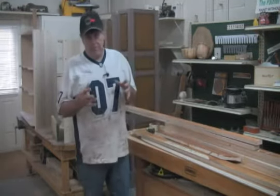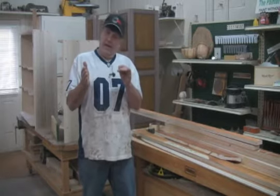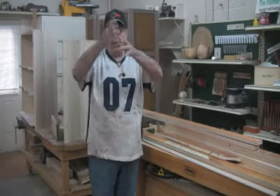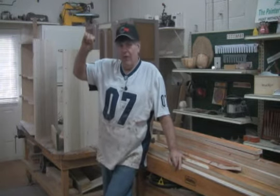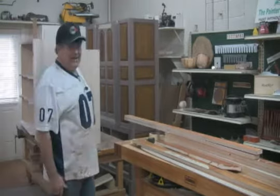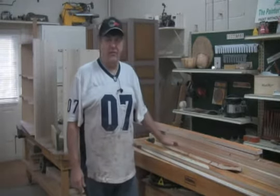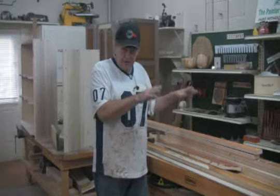So I wound up building a door, a 1 3/4 thick door out of ash and one out of Tiger Maple. What I wound up doing was cutting grooves on the back side and putting in sliding dovetails, but I made each door work independent of each other. At any given time, that Tiger Maple door will either be above the ash or below the ash, but it moves. It does do it a little bit, but in a big door, that little bit was enough to matter. So it will move a little bit. But letting it acclimate, getting it skimmed down, getting that crust off a little bit, then letting it do its thing, then you come back and process it till it's straight in your final dimensions.